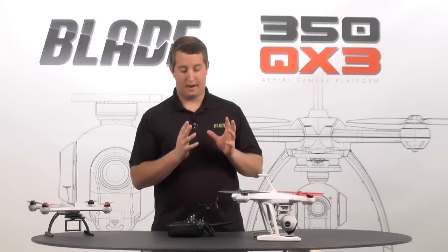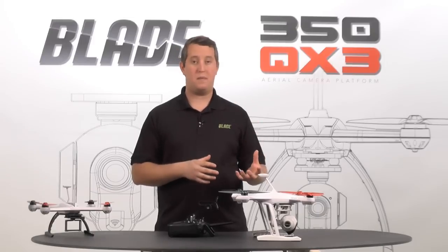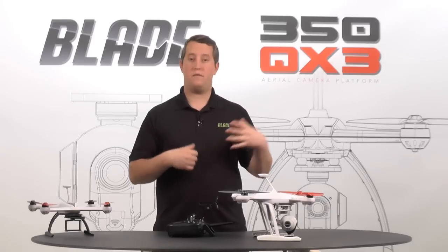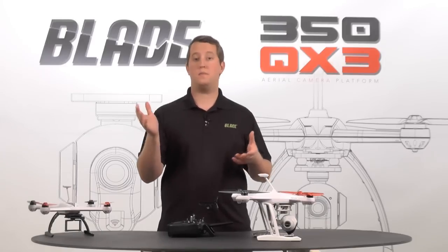The first thing we're going to do is power up the model after we've taken it out of the refrigerator. The refrigerator is important because it cools down the model to about 32 degrees Fahrenheit or about 0 degrees Celsius. You can do it in a deep freezer, any refrigerator, or if it's really cold outside, place it outside. The idea is to cool the sensor down so that it calculates the change over time as it warms up when you bring it inside.